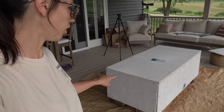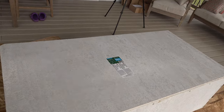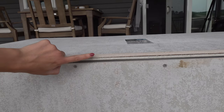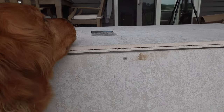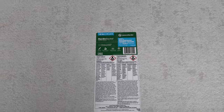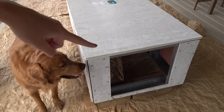A little update on the fire table: we have all the cement board screwed on to each of the sides, with the exception of the top, which is not secured yet. We still need to cut out our hole for the fire pan in the middle. On the top, just because of the depth of the lip of my fire pan, I went ahead and used a double layer of the cement board. The next step is to measure out our hole for the drop-in fire pan, get that cut out, and then we'll be ready to start using our seam tape.